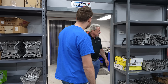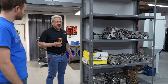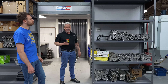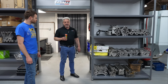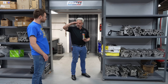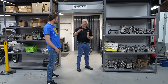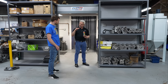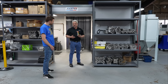As for the ITBs, enlarging the throttle bodies on the S62 really does nothing. The real gain is with the velocity stacks. The real key is the 180-degree bell mouth — instead of cutting them off flat, you curl them all the way around. What that does is increase the velocity and smoothness of the air entering the velocity stack from the side. From the front it doesn't matter, but from the side, a flat edge disturbs the incoming air, whereas a rounded edge lets it come in much faster. On the same car, same day, same dyno, 15 minutes apart — 22 wheel horsepower gain.